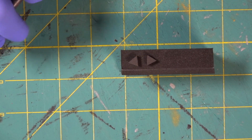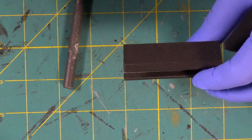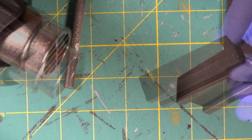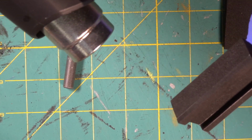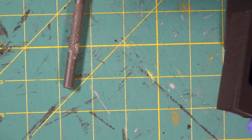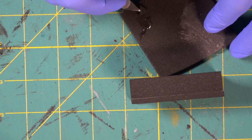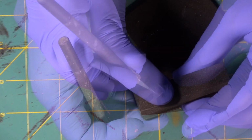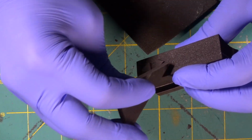All right, there we go, just like that. They're going to go right there. So this is going to be really easy. What we're going to do is take these off for a second. We're going to heat the side of our piece so that it's tightened. Now we don't want to hit it too hard because we don't want to separate the glue right here. We're just going to hit it real fast like that on both sides. There we go. Put a little super glue down. Hold it down while it bonds, and ta-da! A tiny little bit of squeeze out there. Not a problem.